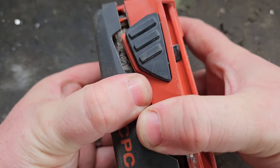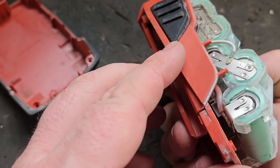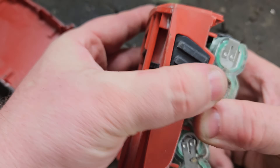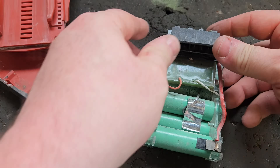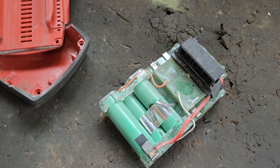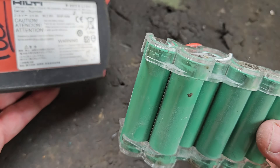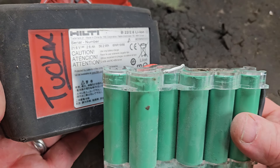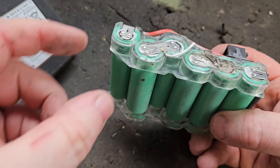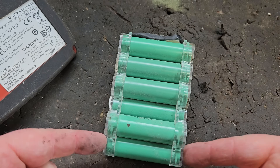If you've got a healthy battery and it's exceptionally low in the volts, what you do is take out the screws and take the casing apart. You don't even have to take it out of the top to get this done, but we'll take it all out anyway. This battery has 6 cells because it's a 2.6 ampere. Sometimes you get bigger ones that are 5.2 — they're just double the cells, but the principle is the same. You measure each one as you go along.